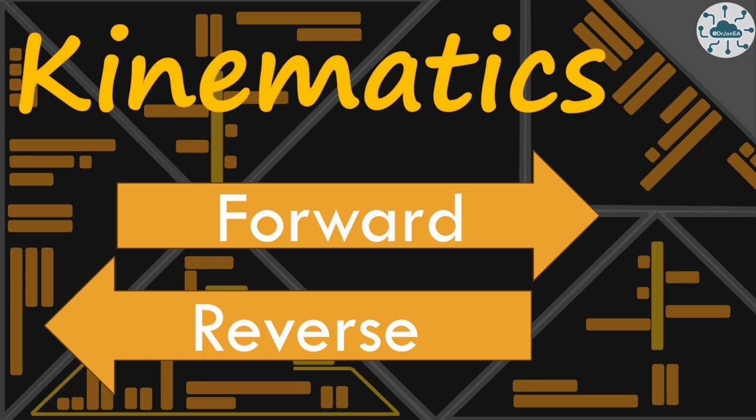So in the forward direction, what we do is take those 4 servo angles and we work out exactly where the lens of the camera will be and what direction that lens is pointing in. And reverse is going the other way. So if we know exactly what position we want that camera lens to be and which direction we want it to be pointing in, then can we work out what the 4 angles of the servos need to be.